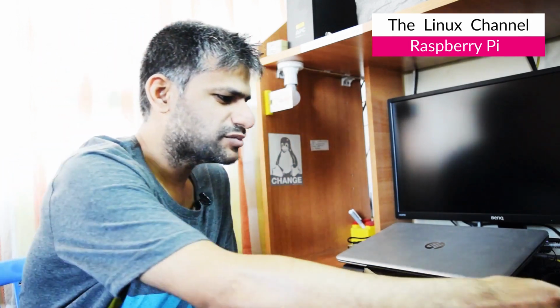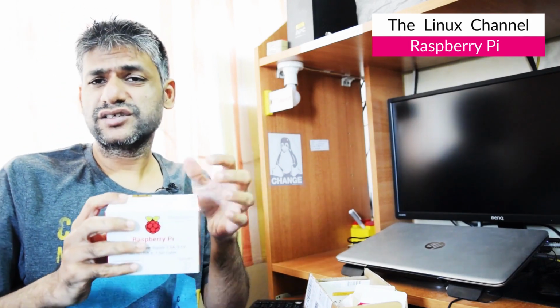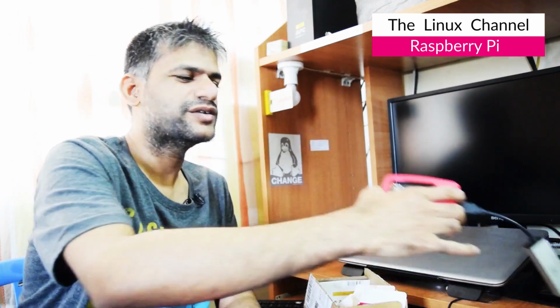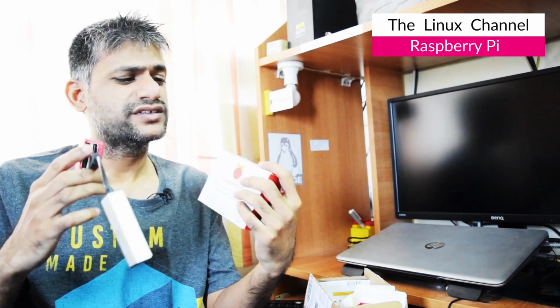So which is why I'm saying you get a very good power supply. And in case you tend to repurpose your smartphone power supply or something, check the ratings, and also be careful that smartphone power supplies may also deliver extra voltage to do faster recharge and other stuff. So you don't need these capabilities for a dumb device like this, because it just needs a proper DC voltage source. It doesn't need any of that intelligent stuff which you use in a standard charger.